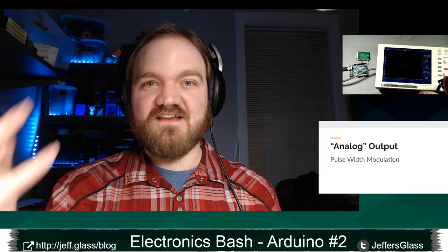All right. Without any further ado, let's zoom this camera back in, and we'll get to talking about analog output, which you can think of in this context like dimming, right? A digital output, ones and zeros, means things are either on or they're off, they're high or they're low. Analog means a continuous range of values, or at least a multiplicity of values in between.